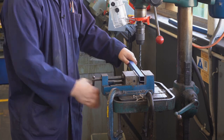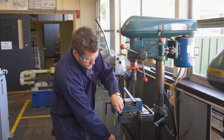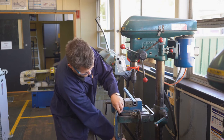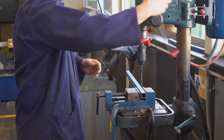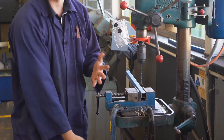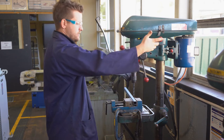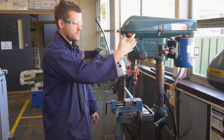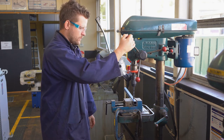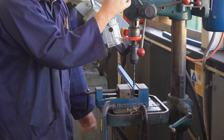Make sure we're in the right spot. If not, simply loosen the clamp, bump it forward to where we need it, check it again — happy with that — and lock it off. Then all we're doing is working our way through. We're not forcing it; it will take a bit more effort than in woodwork, but let the sharpness of the drill bit determine how fast you go.